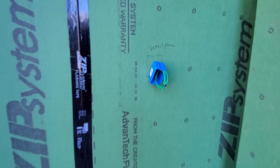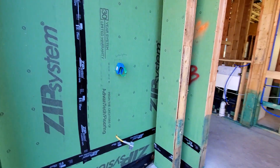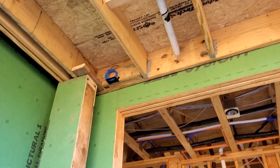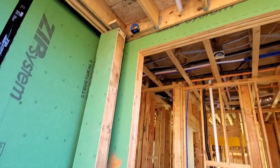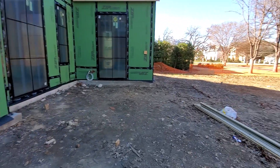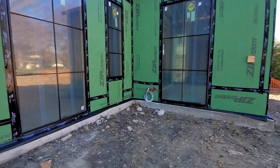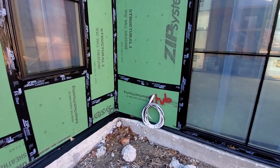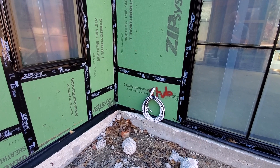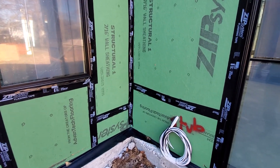We've got a Cat6 there for our doorbell. You'll notice that we color code everything we do just to keep everything sorted nicely. Coming out the top we have another camera looking straight down for full-time recording. This area is kind of like an outdoor entertainment area — there will be a mini wall coming down right through here, so we've got a stub out for speakers as well as low voltage wiring. We've got four or five Cat6s and six or seven 16/4s — everything we could possibly need for low voltage lighting out here in the front yard.